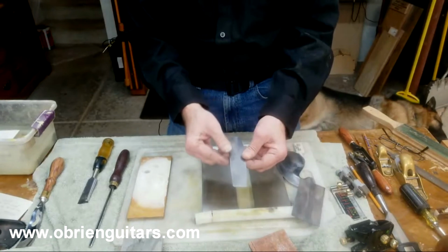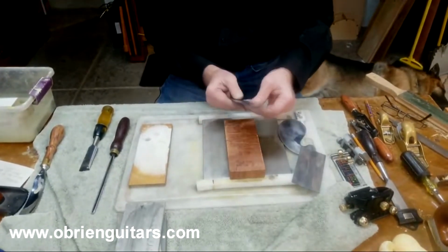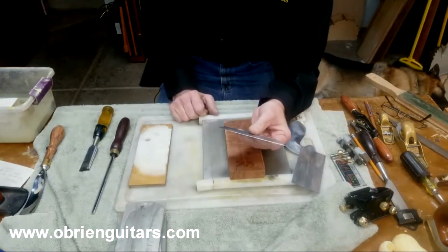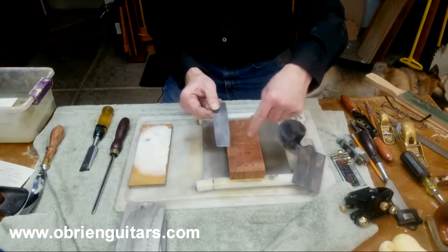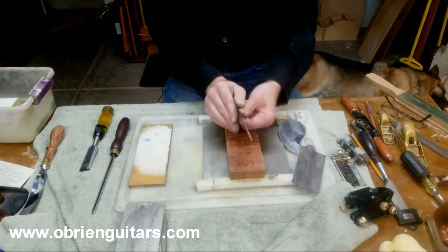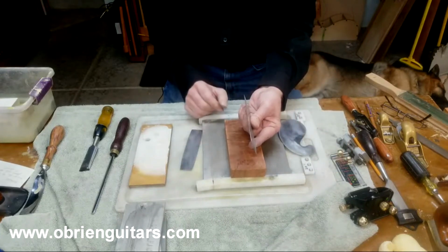And what I've done on this one, this is how I was taught how to sharpen scrapers, is round it a little bit. And then I would walk over to my belt sander and just put it at a 45-degree angle and just do that. I wouldn't hone it at all. And then I would just roll it over. For a rough cut scraper on rosewood or rough wood, it works great. However, if you're going to go to ebony or spruce and do some type of finish scraping, it's going to leave these little scratches and lines and troughs in your wood because I never honed it. I just rolled it over. But that works great, and it puts a big burr on one edge, and it's pretty aggressive actually for doing rough cut wood. These days, I prefer to do it like this because I'm doing a lot of fine scraping and finish work with it.